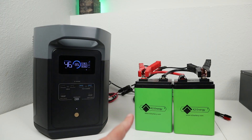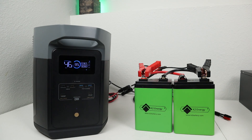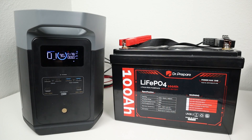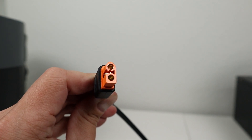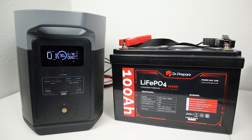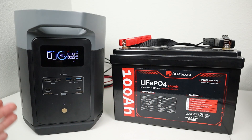Now what about 24 volts? With the 24 volt batteries connected to the EcoFlow Delta II Max — keeping in mind these can't source a ton of power, so I only have it connected to one charging port — we're getting 365 to 367 watts input. So if you had a 24 volt battery that could handle a lot of power output, you could dual charge by connecting up both charge controllers. I also tested with a 12 volt battery on one charge controller using the XT60i adapter, which goes straight to the peak 15 amp input — we're getting 179 watts. You'll want to be careful doing this in a vehicle with a 12 volt socket as you're going to blow a fuse, but this battery can source the power without any problems.